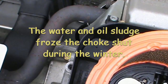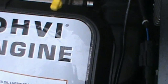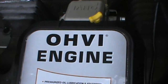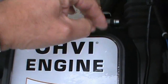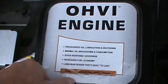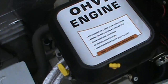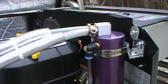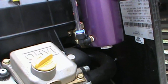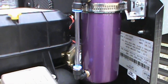So I'm going to show you how I overcame that. I started looking around on the internet and I found a little oil separator. That's it right there. It has a little thumb screw on the bottom you can open up and empty it. There's a sight tube on the side so you can monitor the buildup of the sludge.